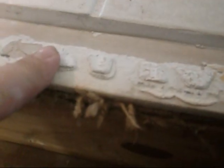That tile up perfectly. We still have the backer board on here, and here's your thin set, and we've got the subfloor right here. So I'm going to try to get this backer board up. Believe it or not, with this blade I got right here, I was able to score that right there. You see it? Now I can take some magic eraser and get that off. But man, that's a trip.